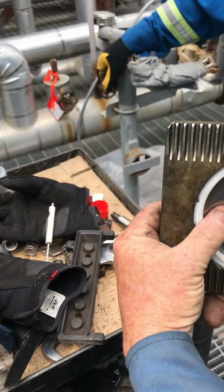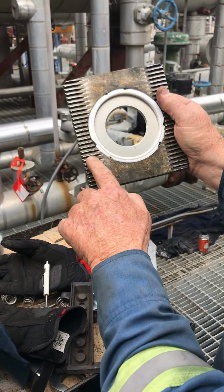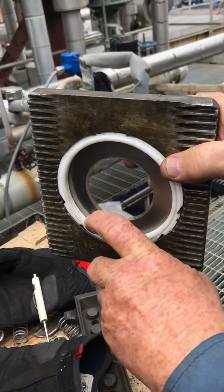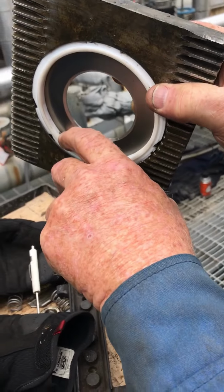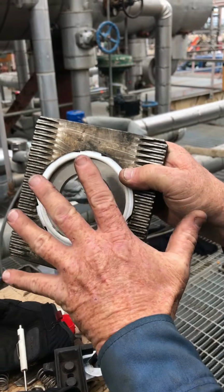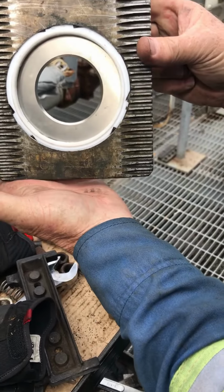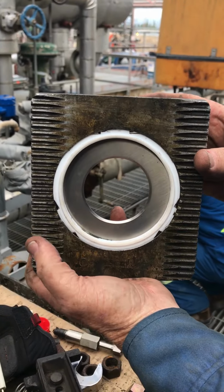Now, when it's assembled, you got the valve carrier all nice and cleaned up. The gears are clean, no obstruction. You got the Teflon seal in with the energizing seal, and you got the plate in with the bevel. So you got the gears, the seal downstream, and the bevel all on the downstream. Everything is on one side. 1, 2, 3. On the top side, on the upstream, nothing, just a sharp edge. That's the proper installation of an orifice plate with a Teflon seal. Never goes any other which way.